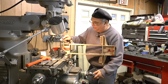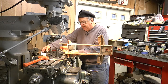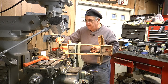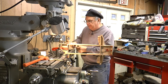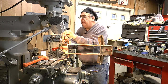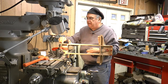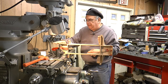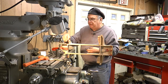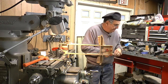I indicated it here with the last word indicator along there. I set it up first against the flat edge across the bottom, and clamped it down. I got to put two clamps so it doesn't move around too much. Now it's set up pretty good. One side at a time: center drill it, drill it, counterbore it - do this piece at the same time and that's done. Then flip it over to the other side: center drill, drill, counterbore from the back, and center drill, drill, tap, and counterbore this for a screw to hold the brake rigging.